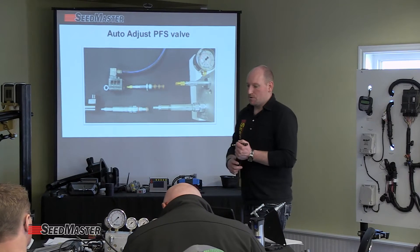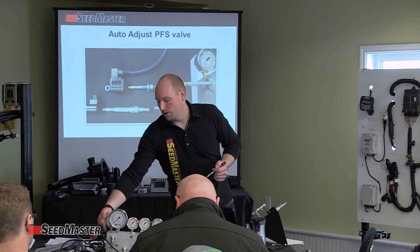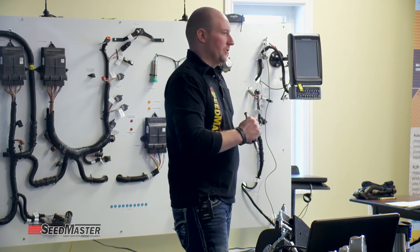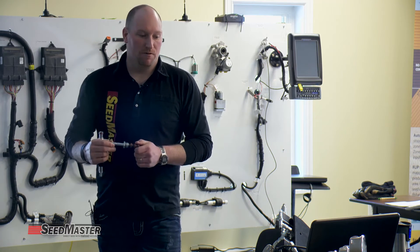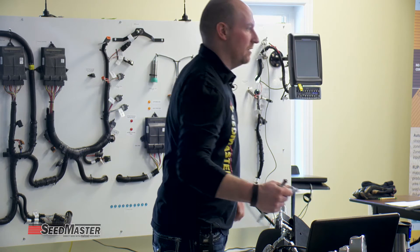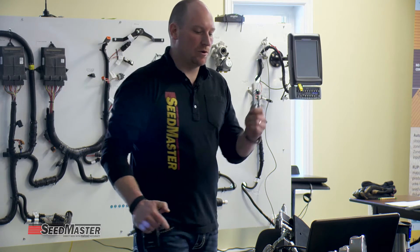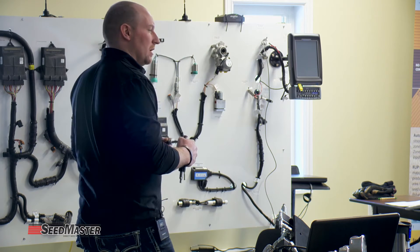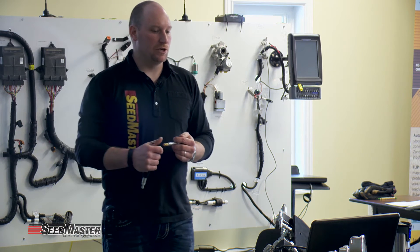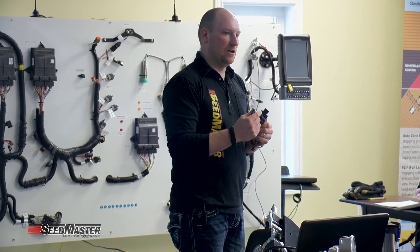Something else I want you to remember is that we require power — which we talked about quite a bit already — to power that solenoid. That solenoid, when it opens, passes oil through one more orifice. I talked about the dump line return having as much as a guarantee of 5 gallons a minute. We have an orifice for continuous wing down flow at two and a half gallons. The orifice is sized exactly the same for the shank top up flow. Through the back of the block, when you turn this valve on, it supplies oil through the back port, flowing at a limited flow through an orifice of two and a half gallons out to that opener circuit. It's just a continuous flow of oil, and then it uses the PWM valve to actually increase or decrease that pressure.